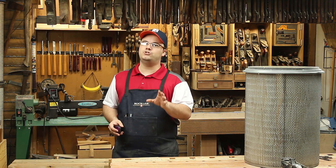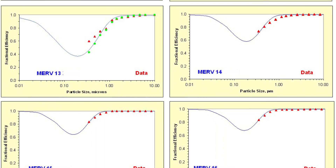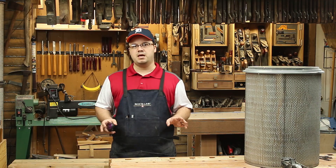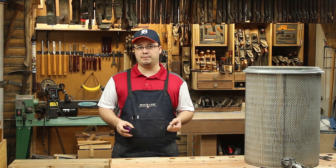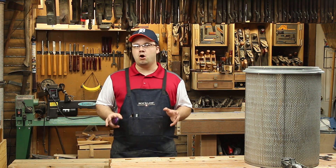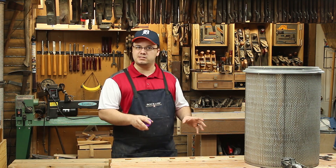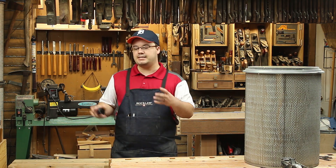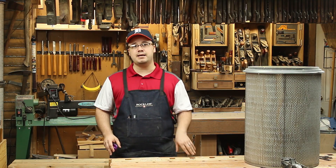Let's talk about filters, and then we'll see how to build one of those manometers. Filters come with different ratings — some are rated in microns, some have a MERV number, some don't have anything on them at all. Here's what you need to know: the bag-style filters are junk. They're catching chips, but they're letting all the fine dust out. Older bags can let stuff as big as 30 microns escape. Some dust collectors have changed over to 5-micron filter bags, but that's still not enough — OSHA requires commercial shops to filter out anything larger than half a micron. A bag filter turns that expensive dust collector into a giant dust pump that blows fine dust into the air throughout the shop.